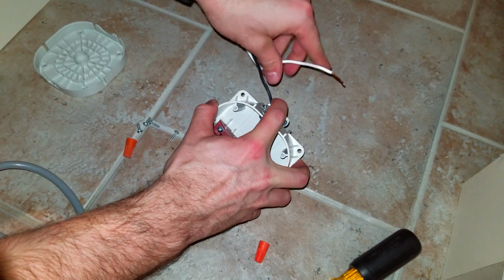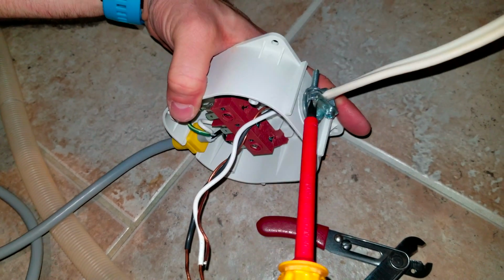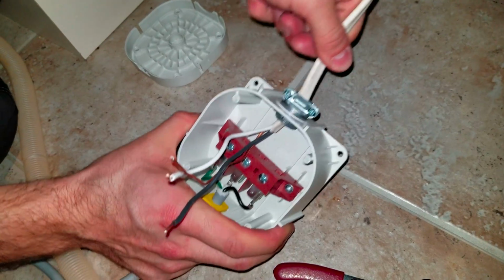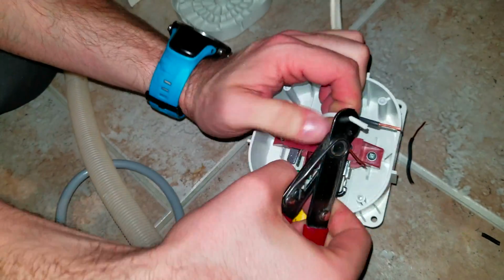Insert the cord inside the electrical box. You must make it all inside up to the jacket, so the crimping tools crimp on it. Now cut the wires so they are not too long. Remove an inch of the jacket on every wire.